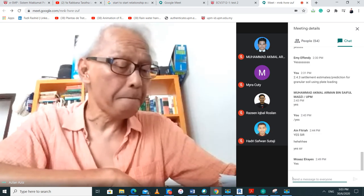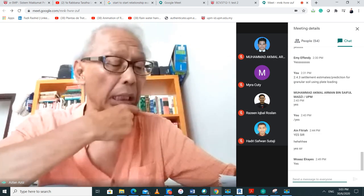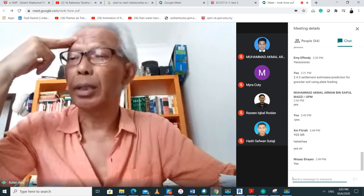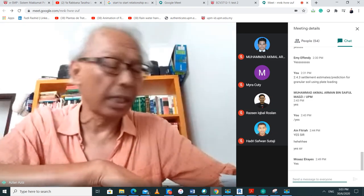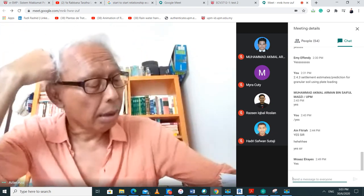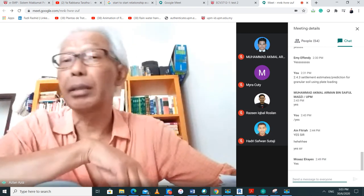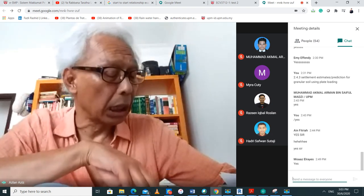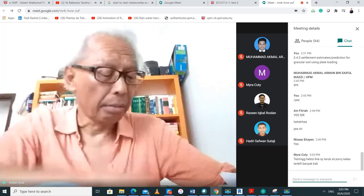Now, the bottom part of that page 14.35 of table 14.6 gives you the average settlement for a more detailed indication. If you have, say, plain brick walls, and then you use brick and reinforce it with concrete, or reinforced brick, or you can have a framed building, or you have this ultimately solid reinforced concrete foundation, you have 300 millimeter average settlement maximum. These are usually very heavy structures. That's why you see the settlement is much higher.